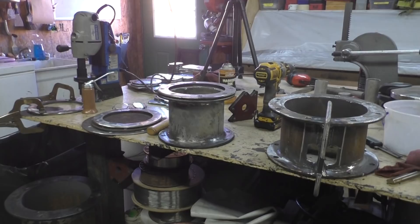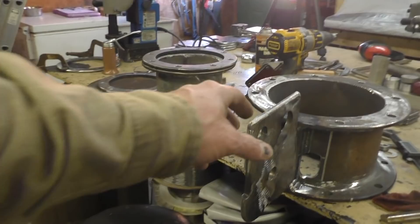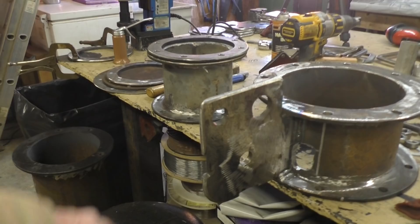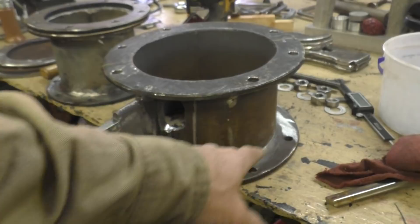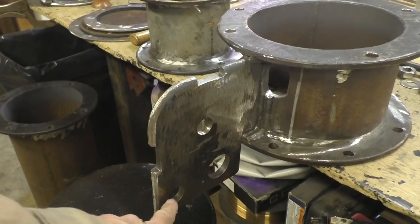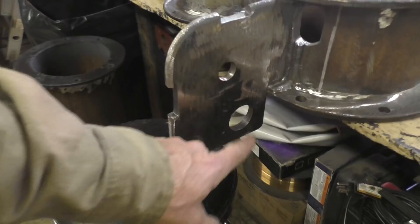What we've been working on last weekend — and the guys are out there working on this weekend — are these mast heads. Dave said he's gonna come over this morning too. A masthead is the piece that goes on top of the mast which hoists the sails up. Our main mast is that big around, we got a flange on it and we're gonna use six half-inch bolts to tie this onto the top of the mast.